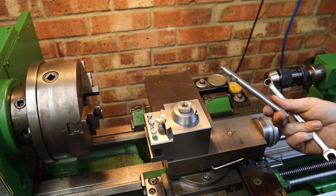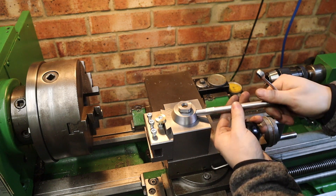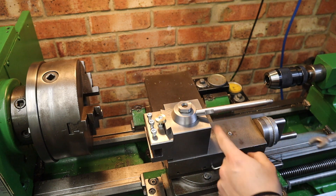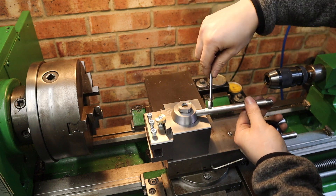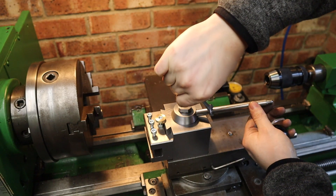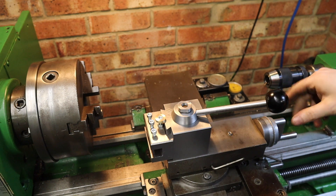The handle is all done. I've got an M8 thread on this side, an M10 thread up here, and I've milled some flat slots so I can tighten it with a spanner — just a 10mm spanner. Final feature: screw a ball on the end. Done.